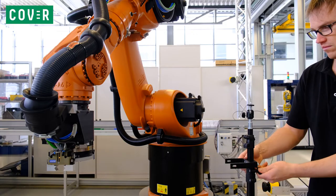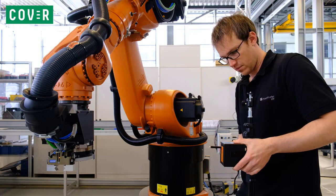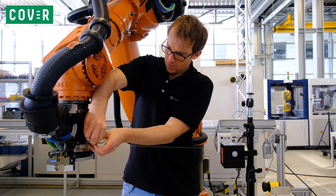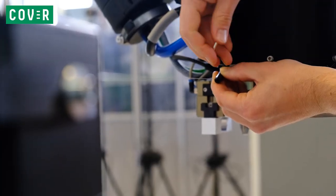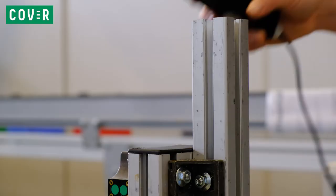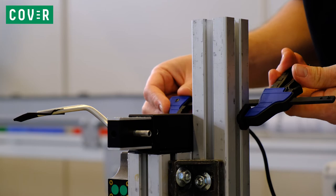The wire encoder must be placed at the position where the human could enter the workspace. The loose end must be fixed at the position on the robot's surface with the minimum distance and highest velocity. In this scenario, this is the end effector. Next, the flag actuator must be placed such that it reliably triggers the safety sensor.